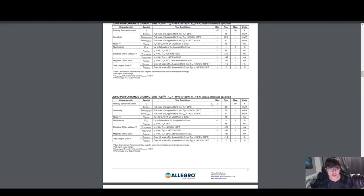Before we end, here's a summary table for reference. There are five methods of measuring current: shunt resistor, Hall effect, current transformer, Rogowski coil, and fluxgate. The table covers connection type, current accuracy, range, drift, and isolation. Isolation is relevant because the Hall effect IC senses magnetically rather than passing current through it, while the shunt requires breaking into the circuit with no isolation. Keep these parameters in mind when choosing a sensor for your project. Please pause the video, take a screenshot, and I hope this table helps you decide what you need.